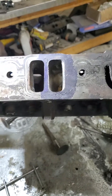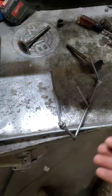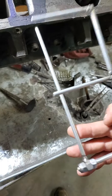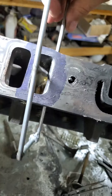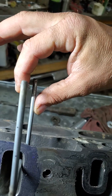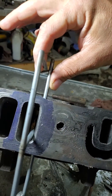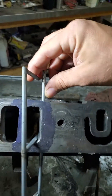I just made this out of some scrap I had laying around — this is just 200-thousandths rod. I'll show you how it works: you stick the straight piece up in there, it goes in, you pinch it right here, and then the gap between the two arms is exactly twice the thickness of the push rod wall. You can move it up and down and the gap changes. This one I'm basically done with — it's about an eighth-inch gap, which means the wall thickness is about a sixteenth.